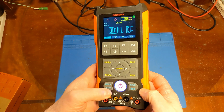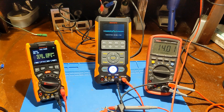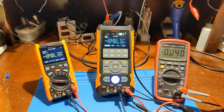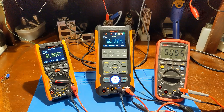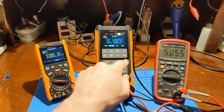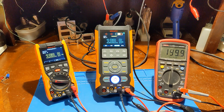Let's do some metering. When the multimeter is turned on, it defaults to voltage DC. I currently have the power supply set to 14 volts. Here is the value compared to the small Gooch and the UNI-T. I've switched over to AC — I'm currently feeding it a 14 volt peak-to-peak 50% duty cycle 200 hertz signal. These are measuring RMS, so that's why it's showing 5 volts. Frequency is next, and yeah — they all agree with each other.